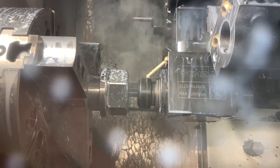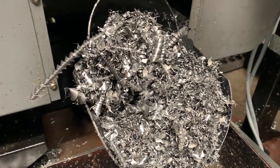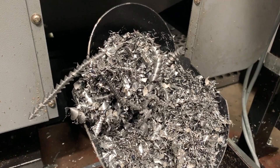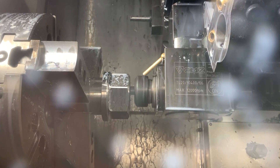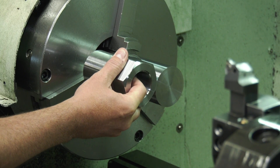The biggest problem with automation in our eyes is swarf. Before, we used to u-drill the hole and bore it out, but we found that the amount of swarf being generated could get stuck in the chuck — as a tipped tool it would become stringy and get wrapped around the jaws. So we went to use two u-drills with minimum boring out. Screw cutting the internal thread was also a challenge because of the swarf, so after numerous trial and errors we settled on thread milling.